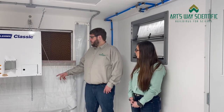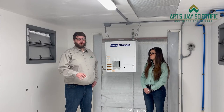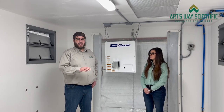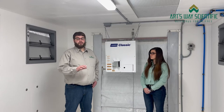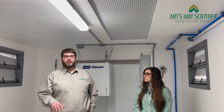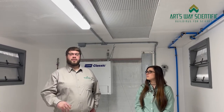During the winter, we have an adjustable curtain which allows you to restrict the amount of air coming in. During the cold months, when the air comes into the preheat room, it is heated by our 60,000 BTU LB White heater. From there, when that air moves into the other rooms, it is pre-tempered and you don't have raw air dropping down on the pigs. In this configuration, we use our attic as our ductwork. Above, you'll see a grated ceiling where air enters into the attic and is then distributed into the other rooms.